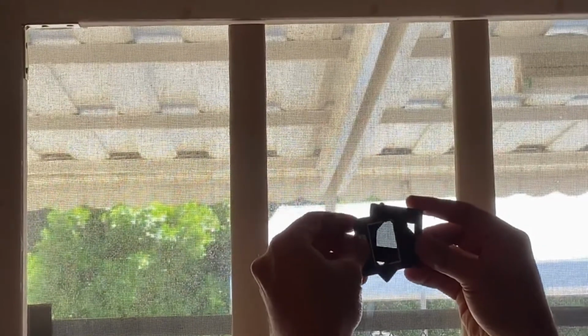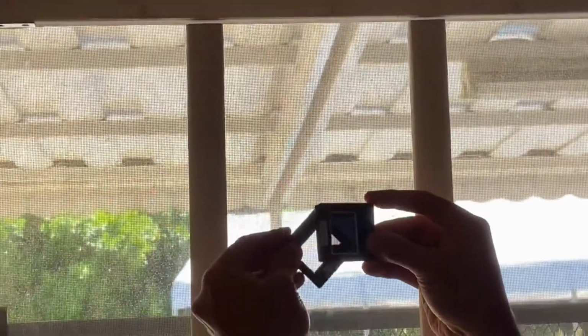And this is precisely how LCDs work. Because as you might remember from that animation in the chapter 25 video, in the LCD you've got a series of crystals that rotate depending on whether a voltage is applied or not. They're acting as polarizing filters. And if I were to just keep gradually twisting things, I would still be able to see light, even though the final one would cause blockage without anything in between it.